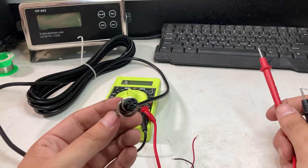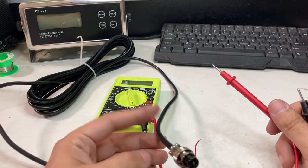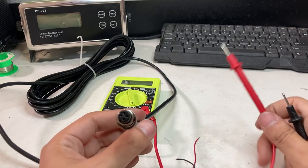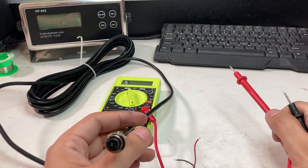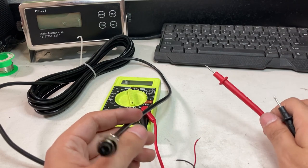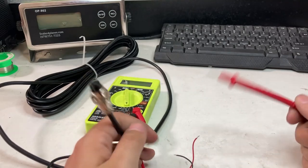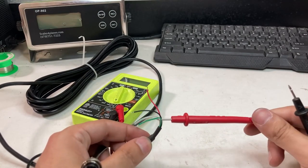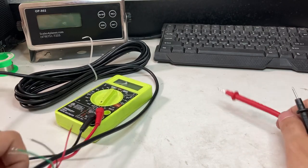A home run cable runs from the 900, 901, or 902 indicator to a floor scale, bench scale, bed scale, or another floor scale. Check if the cable is fine — if you still have no reading it may be a load cell that is worn out, but a lot of times it's just the cable itself. Check the connections, use a multimeter for continuity if needed, remember the pin-outs, and hopefully that helps you resolve your issue.